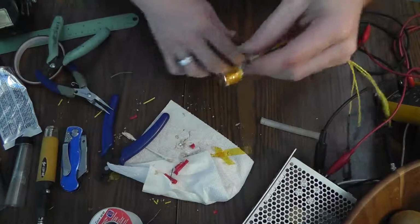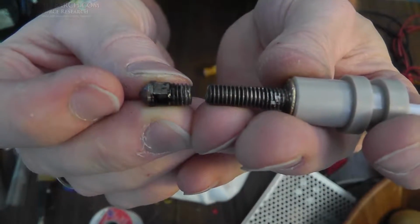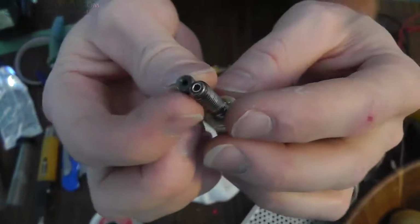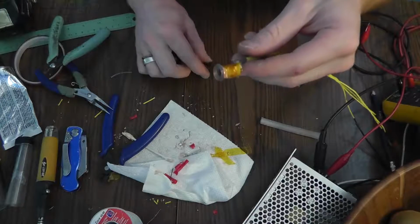The other thing is I'm going to use PTFE tape. I'm going to wrap them on here when I assemble this, and that'll allow all the plastic not to squeeze out the wrong places. However, you want to make sure you don't get any wrapped in here because it'll try to go out the nozzle and clog it up. Let's go test this thing, see how it works.